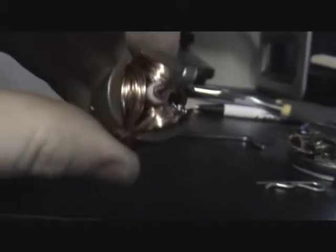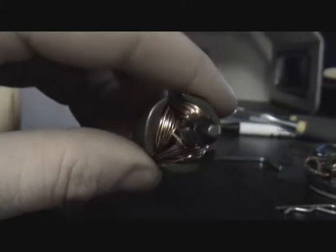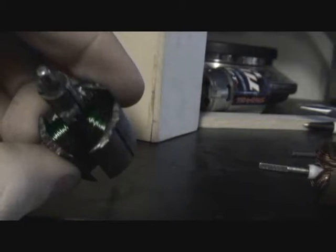One of the armature electromagnets was wound wrong — either one less or one more too many winds, so it's vibrating quite a lot. So I re-wound this one with a 26 gauge wire and this is a 45 turn motor. Could have had a few more winds on there, but I thought I didn't need too many winds. So I'm going to test this one out and see if it works better.